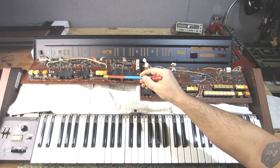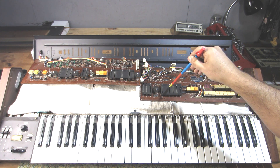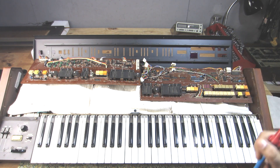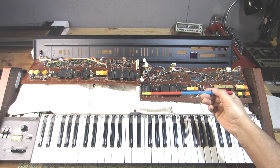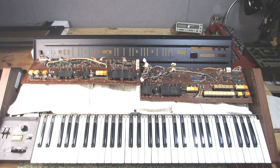You can see how much fuzz and crap is all over the boards — a lot of dirt. It works its way into the openings and causes problems. Then you've got the original factory lubricant that they lightly smeared on the resistive track to give everything that nice smooth feel — that degrades and gets viscous. Add to that the fact that this was stored in a non-climate-controlled environment. These things are really rough, and some of them are probably going to have to come out for deeper cleaning, which means more time and higher cost. The customer and I are going to discuss that.